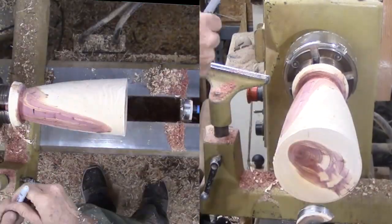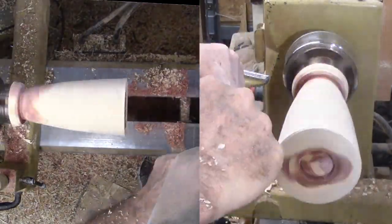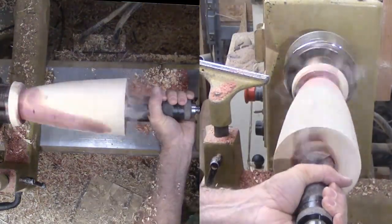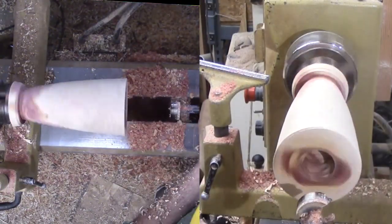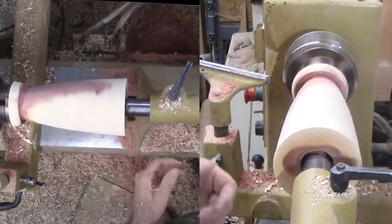At this stage of roughing, I think drilling out the center will be enough to relieve drying stress and allow the wood to dry. I have selected a large enough Forstner bit that the bit is bigger than the chuck that holds the bit. That means I can drill much deeper than the length of the bit, but up to the extended length of the tailstock. The wood is wet, so I need to keep clearing out the chips.